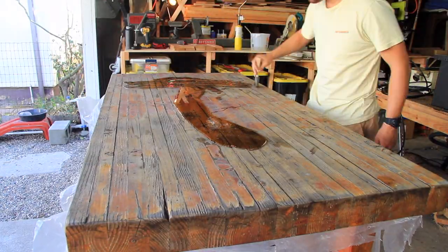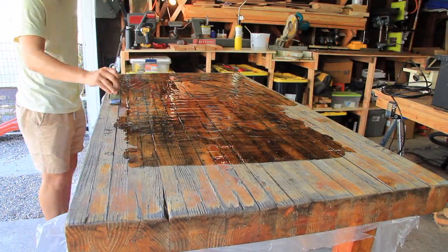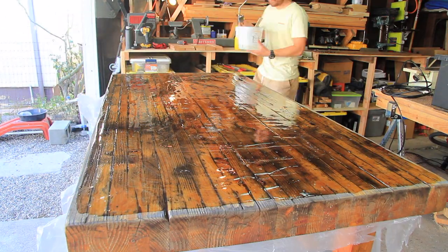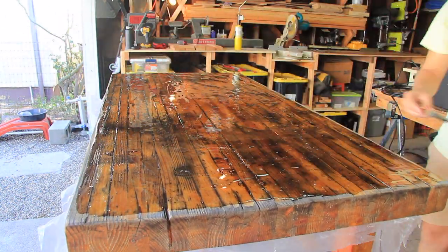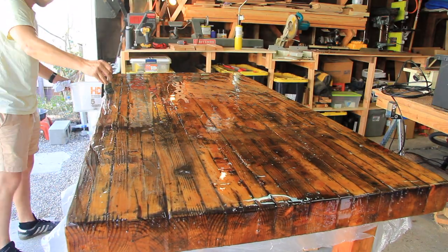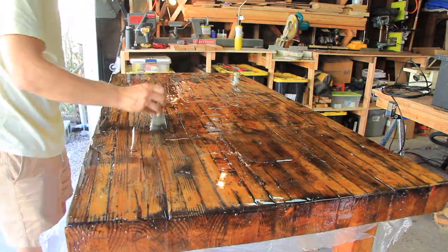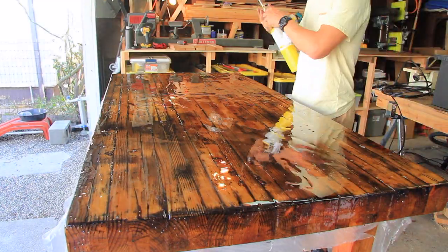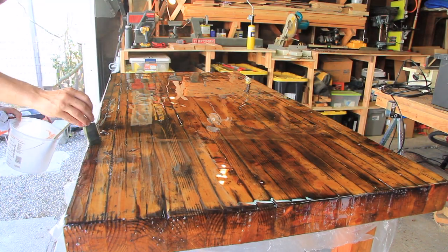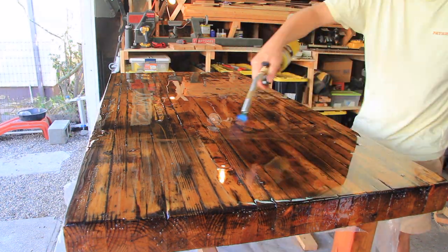There are lots of different methods for how you can apply this tabletop epoxy. The way that I do it is I usually gradually pour it across the center of the table and use a foam brush to spread the epoxy as equally as possible across the entire tabletop. Then I move on to spreading it to the sides where it ends up dripping over the edge, and I use the tool to break the surface tension so that it equally spreads. I then use my torch to pop any bubbles that accumulate as well as help the epoxy self-level — the heat of the torch actually helps the liquid epoxy to equally spread across the tabletop.